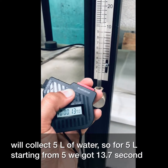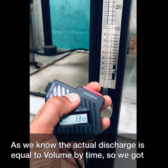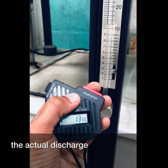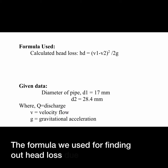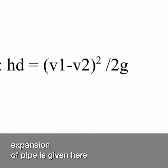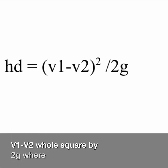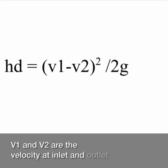For five liters, starting from five, we got 13.7 seconds. As we know, the actual discharge Q is equal to volume divided by time. So volume is five liters and time is 13.7 seconds, from which we can find the actual discharge. The formula used for finding out head loss due to sudden expansion is HL = (v1 - v2)² / 2g, where v1 and v2 are the velocities at the inlet and outlet respectively.